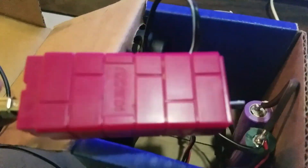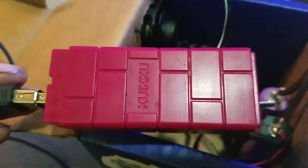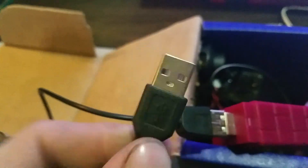I had a gas station battery bank. All this thing's job is to do is charge an 18650 lithium-ion battery. So I took the battery out, soldered it with the other battery that came with the soundbar — they had the same battery, oddly enough, both purple 18650s. Little USB extender, charge it, throw it in the box — crap works now. Not quite as intended, but it works.